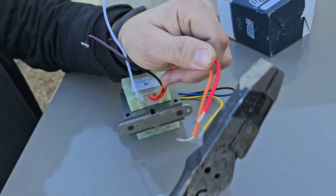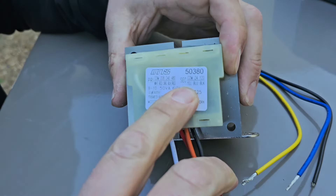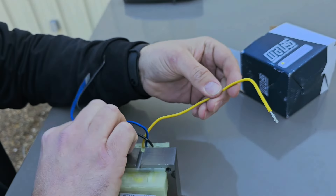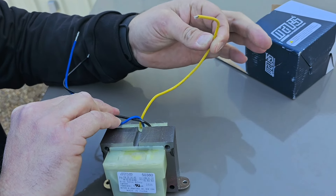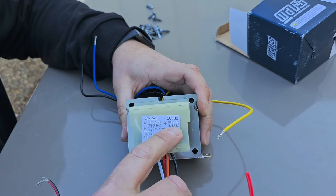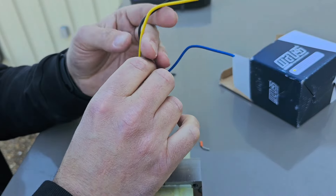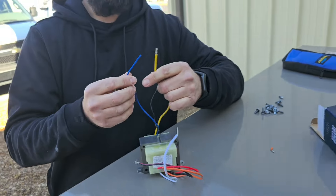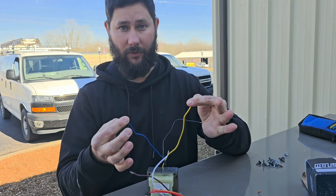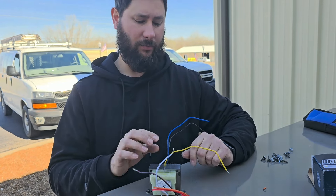So we're going to take those two wires and cut them — those are out of the equation. Going back to the secondary: the common wire for the secondary is yellow. So out of blue, black, and yellow, we have to use the yellow — that's one side of our line, our power output from the secondary side. Then we've got blue, which is 24 volts, and black, which is 120. So the blue we will not use. We're going to use the yellow and the black. If we hook up black and red and white to our 480, checking from blue to yellow we'd have 24 volts, and from yellow to black we'd have 120 volts.